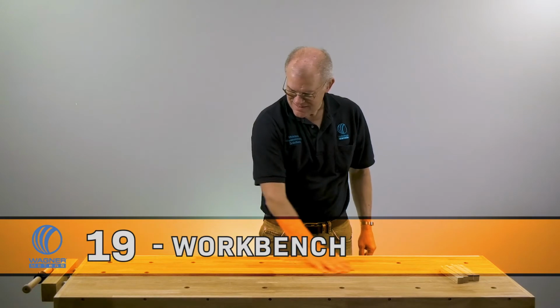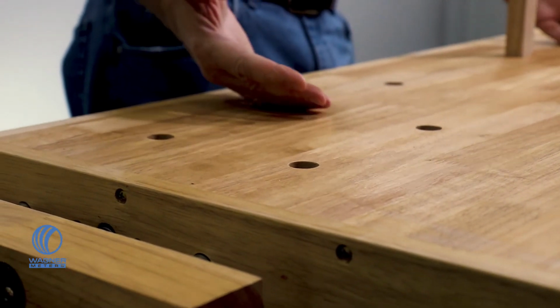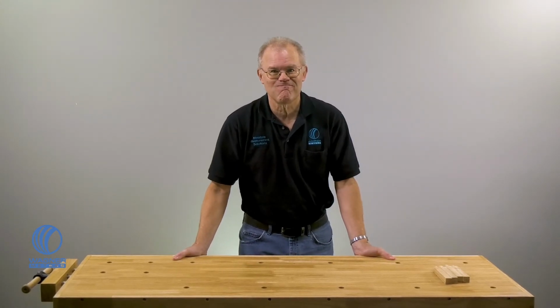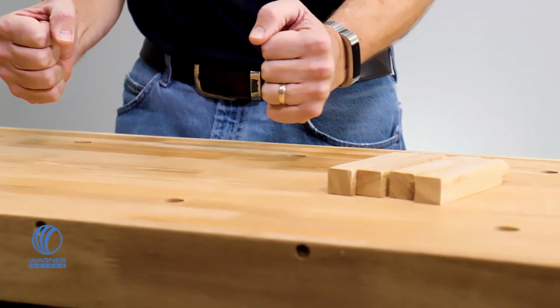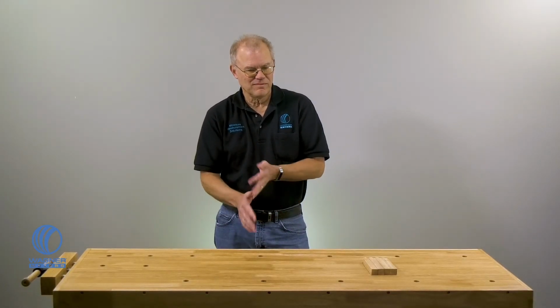You'll need a workbench or work table in your shop. Don't try to be noble and make do with the table for your table saw. It won't be big enough or stable enough, and your saw will get in the way. You can get patterns for your workbenches too, just like the sawhorses. Your workbench can be portable on retracting or locking casters, or it can be fixed. It can be however you want it. There aren't any rules about measurements, since workbenches are usually based on your needs.